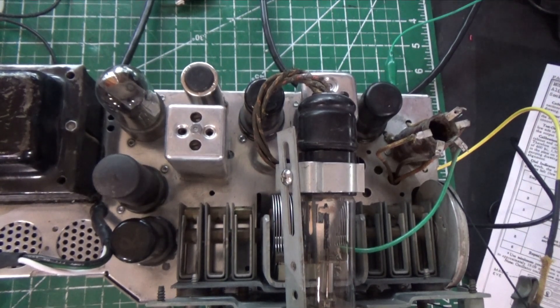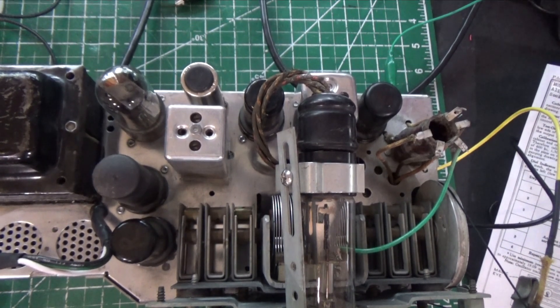Let's show you what equipment we're going to use. First of all, we've got the signal generator set to 455, calibrated through the oscilloscope. I have the red lead connected directly to the antenna terminal on the back of the radio, and the ground lead is connected directly to the chassis.